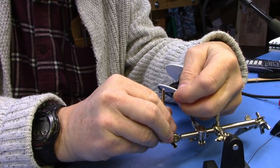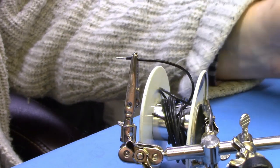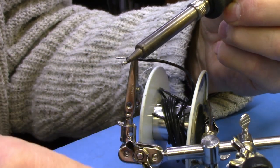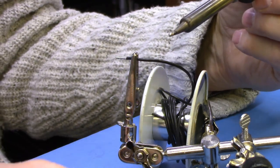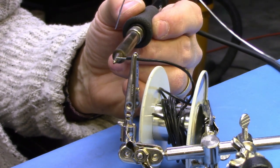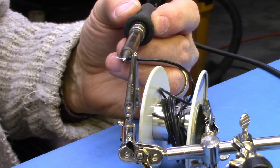Now we're ready to do the soldering process. I take my soldering iron and clean the tip real well, then put a nice glob of solder on the end of the iron — because that solder on the iron is actually going to contribute to the solder that tins the end of my wire. I'm going to put the soldering iron underneath the wire and then add additional solder to the top. I'll start at the end and move in. It looks like I could use just a little bit more.